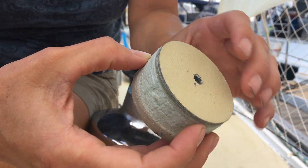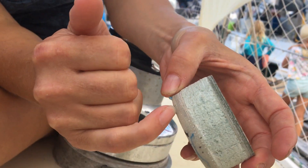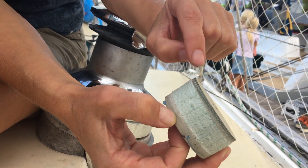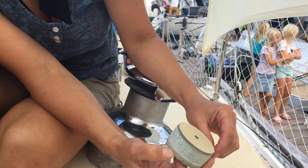This photo is taken quite near the edge which is why there's a bit of a messy finish. But normally the inside fiberglass sandwich layer would be about this thick, then we've got the blue closed-cell foam, and then the new epoxy layers on top. We decided to finish the deck with non-slip — it's not perfect and needs a bit of a clean. We could also have put fake teak on and might do that at a later date, but this is what we could afford at the moment. We're pretty happy with it — it's a smooth finish considering it was done by us.